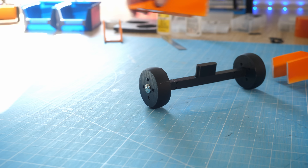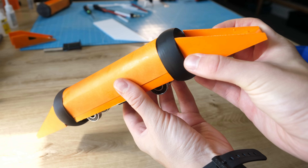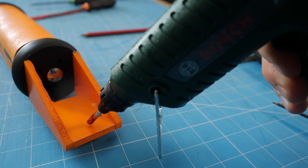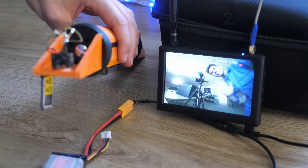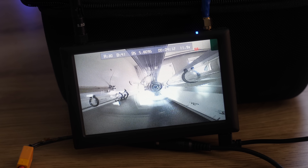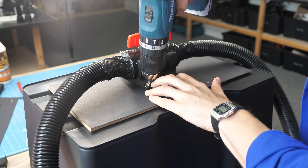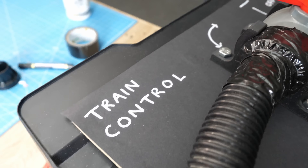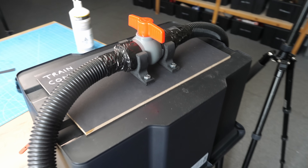This gave me an idea of how I could take this whole vacuum-powered train to the next level. I wanted to build a second train that would fit within the tube, turning the vacuum railway into a sort of hyperloop. I put together another thrust carriage with angled ends and drew on some windows to make it look the part. I added an FPV camera so I'd be able to drive the train from a first-person perspective using a pair of video goggles — the sort used on drones that wirelessly transmit video to a headset. I also made a simple train controller using a valve that could be opened and closed smoothly for greater control over air pressure, which would also allow atmospheric braking to rapidly decelerate the train.